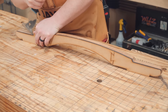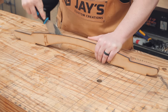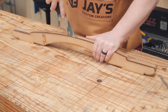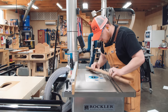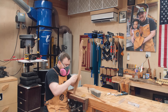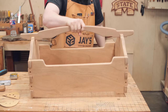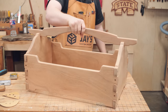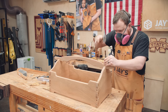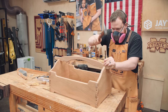Because this handle template is a three-piece assembly, I do not recommend pulling it directly off the wood. Instead use a putty knife to slice away the double-sided tape — this results in less stress on the template joints and allows you to use the template over and over. The handle gets the same round over treatment as the other pieces and more sanding to finesse the shape and final thickness to tightly fit in the handle slot. The main time consumption for this entire project is just sanding. The resulting fit should be really tight, and due to the direction of the grain on the side panels there shouldn't be any risk of splitting. With the handle pressure fit and not moving, the square hole process is repeated on both sides. I didn't want to attach the handle with epoxy and screws at this point because I wanted to be able to remove it and set the whole piece on its side when installing the ebony plugs on the sides.